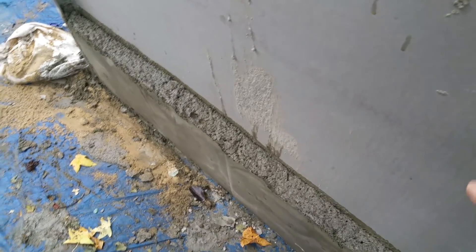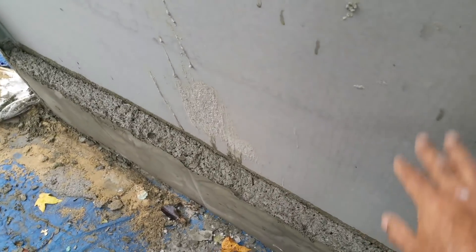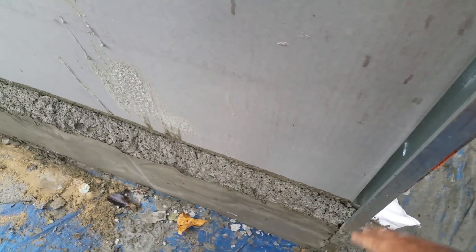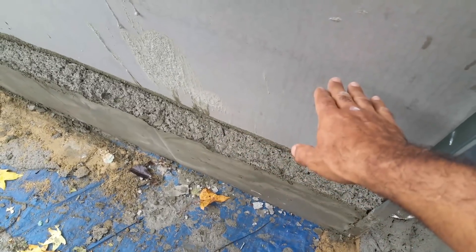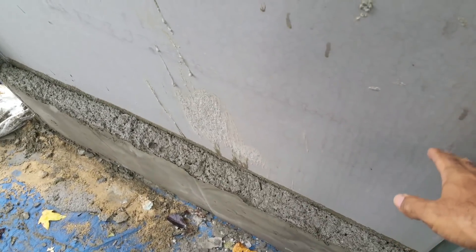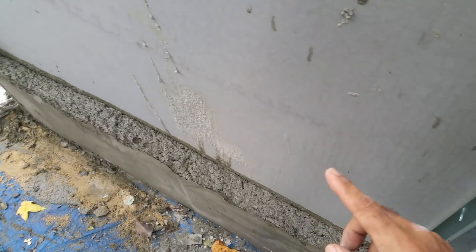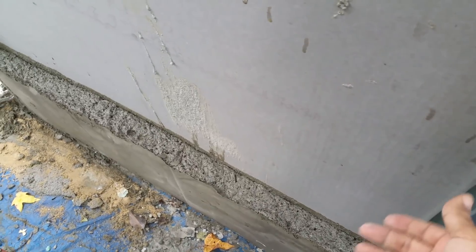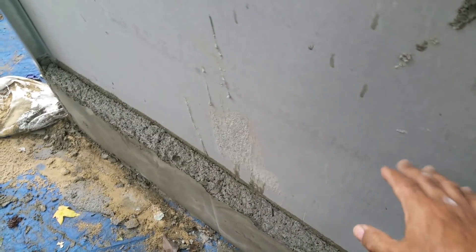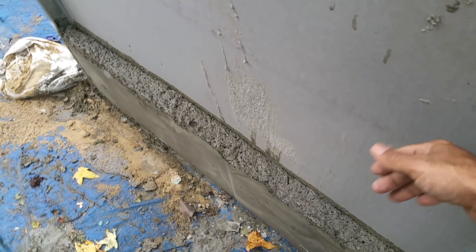This was about 80 pounds of cement. When I did this, the sheetrock was old and the screws on the bottom popped out, so a lot of my aircrete escaped because the sheetrock was really weak. The lesson I learned: don't use sheetrock, or use new sheetrock — or I could use a plastic bag as a liner, which would have been the easiest solution for this experiment.